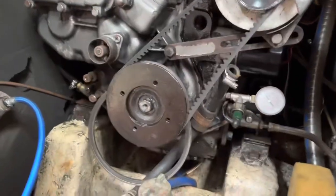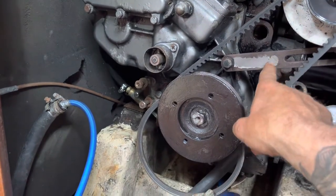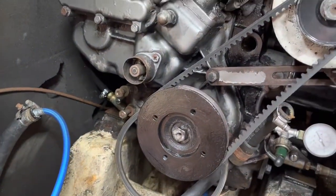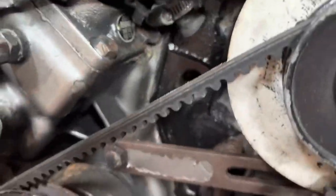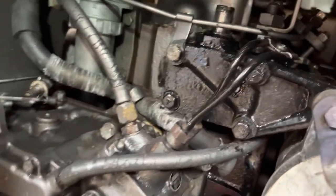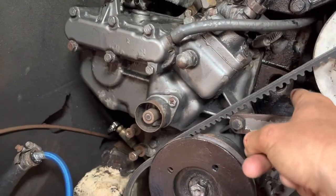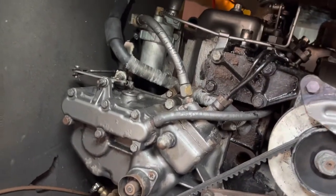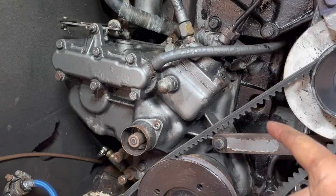I think we've done a good job today — sanded the rust, not all of it. I can see there's bits of flaky paint here that could have had some TLC, but you have to draw a line somewhere. That front wheel area was actually really accessible. I've rust-proofed the main places that seem to be having a tough time. I've painted the fitting that goes in there too. Can't get the other zinc out, so it'll stay in to the end of the season. I've swapped out this zinc here, so when it goes back in there'll be a brand new zinc all sealed up.